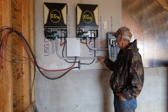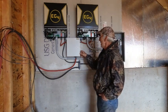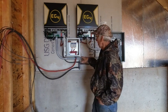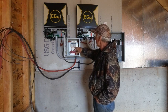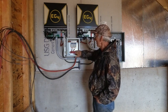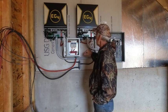In the battery area, it's required to have a disconnect on these batteries. I've got a 4-0 gauge cable coming in and a 4-0 gauge cable going in, with 2-0 gauge cable going out to each inverter. These were kind of a bear to make up, and most other DIYers I've seen have not enclosed this in a box.